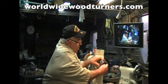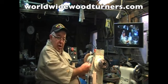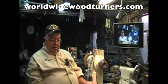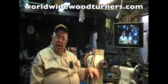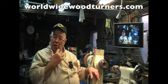That woodworm screw. And the same thing happens. You insert it. You get it in right position. It's got a shoulder to keep it from going too deep. It's got a shoulder to keep it from coming out. The woodworm screw becomes part of the chuck. That is an excellent idea. In fact, it eliminates the wood chuck thing if you have the woodworm screw. It's strong, it's coarse thread, it bites, it holds, it does what you need it to hold.